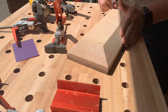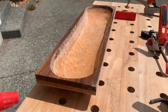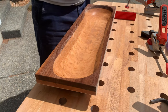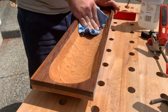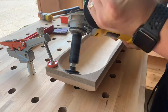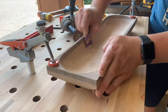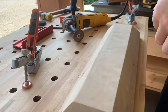You're going to have lots of hand sanding to really get it right where you want it — just knocking off those corners. Here I'm going to raise the grain, since this is going to be a bowl that comes in contact with food. After you wash it the surface will get really rough if you don't do this step, so just lightly spray some water, let it dry, and then continue sanding. This raises the grain — really important. Then I'm back to sanding with the contour sander using the finer grits. You don't want to go too deep or you'll have to keep raising the grain, but you can really get that look you want.